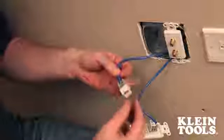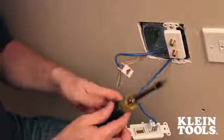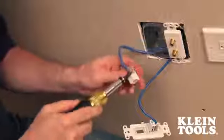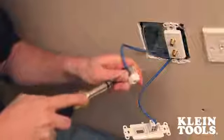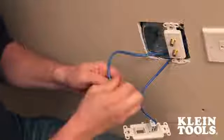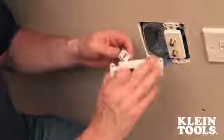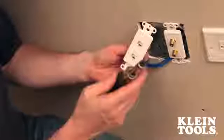Now that you have your cable recut with new wires laced into your wall jack, you're ready to go. Take the punchdown screwdriver tool, switch it around to the punch side, and then you can simply begin to punch down each of the wires in the jack. Now that you've punched that down, you're ready to put your wall jack in, and you can put it all back together using the same punchdown tool.